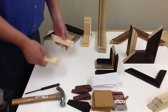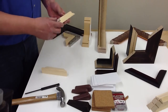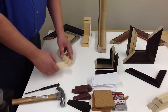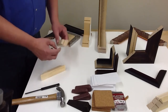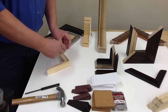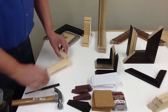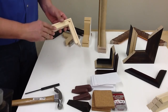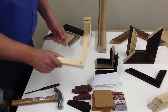And lastly, I want to show you two examples of stretcher frames. Stretcher frames, or strainer frames, of course, have a lip for the canvas, and you could assemble them just like you do with profile molding, upside down with cards or a wedge on this side. But really, the easiest way to do a strainer frame is to simply route all the way through and insert the key from the front. We can route all the way through, because once the canvas is stretched over the frame, you don't see the front anyway, and that's a fast and easy way to assemble a strainer or stretcher frame, because you have a flat back side here and you drive the key in from the front.